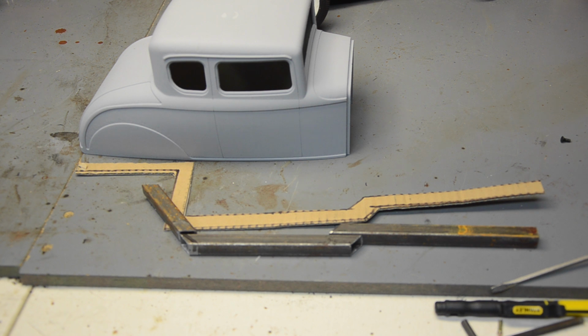So I'm gonna go ahead and weld these things together in this configuration, and then I'm gonna start looking at bracing. Once I have that all as a whole, then I can start looking at how I'm gonna cut it better, because I can't use the bandsaw. I tried that with the number three, and it just will not cut evenly. It tries to walk from side to side, and you end up getting one side a little thicker than the other, and it's just too hard to cut that small of metal with the bandsaw.